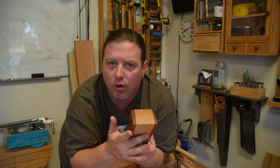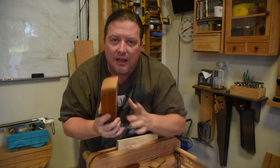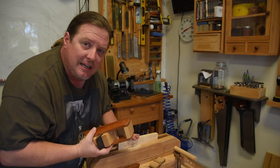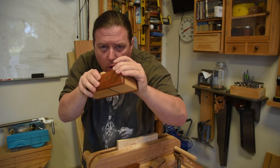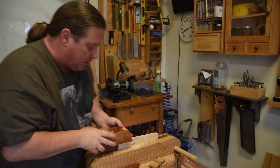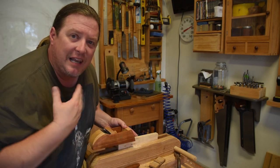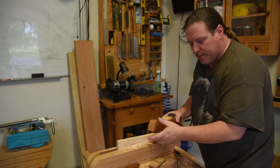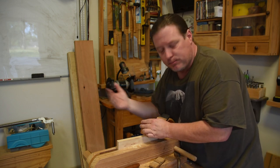Let your fingers control the depth. Also, as you're planing, a lot of people will plane the board with their hands on top trying to get 90 degrees — and that's great — but it's hard to tell as you rotate it. If you slide your fingers underneath, all of a sudden there's more of a sensation. You can tell in relationship to the board since you are now touching the board. Beforehand you're not touching the board, so what are you drawing your 90-degree relationship to?